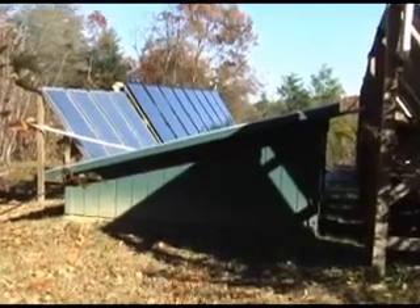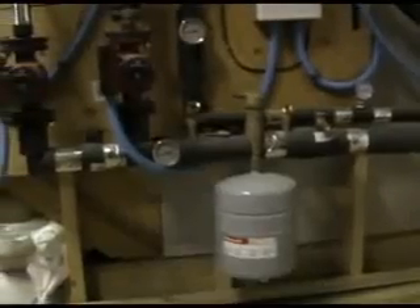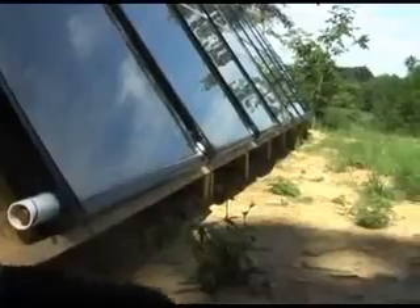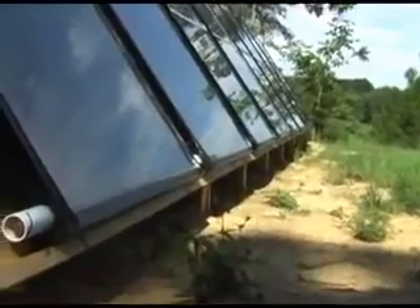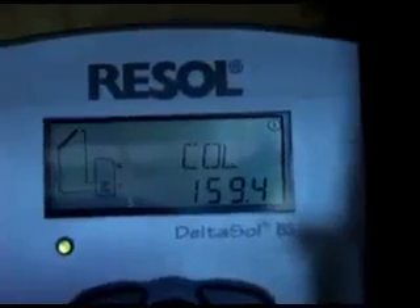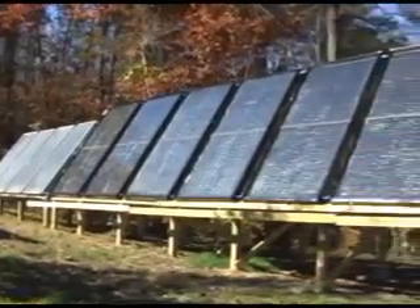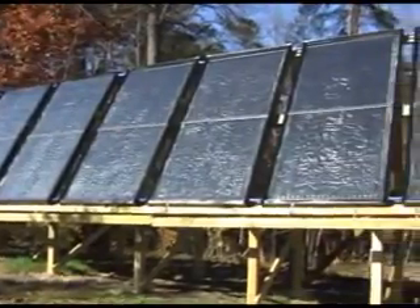And there you have it — a heat storage tank and distribution system. I chose a 4,000 gallon water tank so I could store enough heat to span 4 or 5 cloudy days. I hope someday to add enough solar panels to collect double my daily heat requirements. The first 12 panels provided 50% of our heat for the first two winters. We are now up to 20 panels and anticipate approximately 80% of our winter heat will come from the sun.